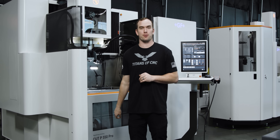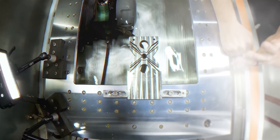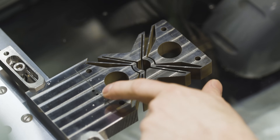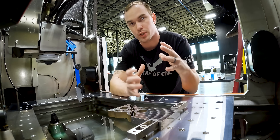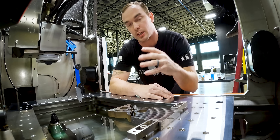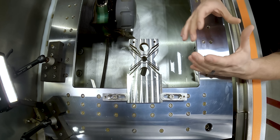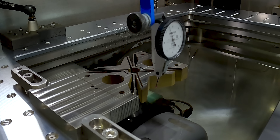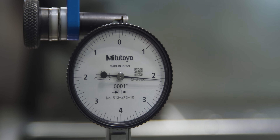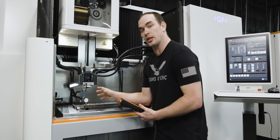The rough profile cut for our butterfly flexure just finished — let's go ahead and pull the slug out. At this point we've roughed out our entire flexure and the part is held by a three-eighths-wide tab. We wanted the part to relax, spring, and move wherever it's going to before we come in with our finish passes. After throwing our indicator on, our part has sprung a little over two-thousandths. If we had run standard technology and offsets this would have come very close to not cleaning up, but since we duplicated our first skim cut we know we have plenty of stock.